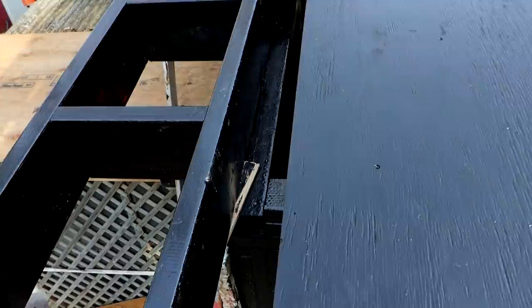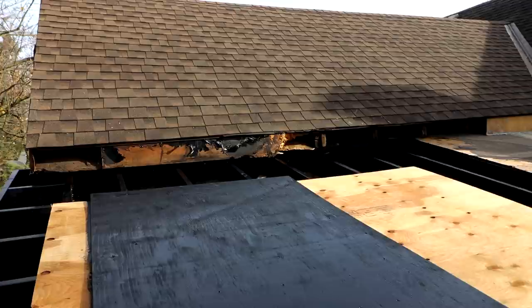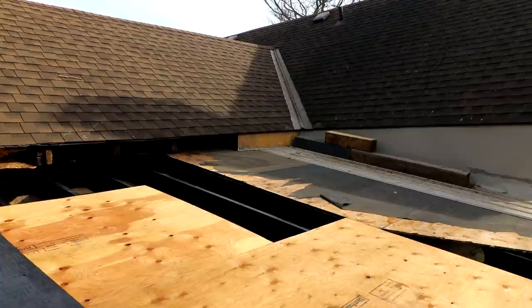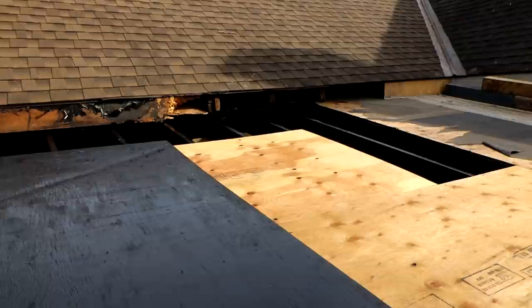I'm going to start putting the plywood up today. I'll start on the bottom edge here and work my way up. When I get close to the old soffit and fascia, I can tear that all apart and fix and replace it, and then do the final bit of roofing at the top. The fascia over here is just thin plywood, so that all has to be taken apart eventually because I want to put eaves troughs along this side of the building. Just the one eaves trough down here gets overwhelmed in a heavy rain - two will help. I'll channel it all down to rain barrels.